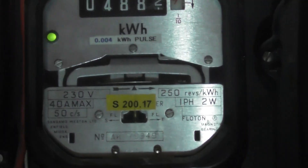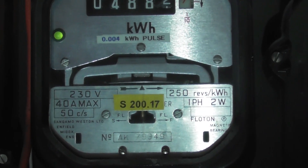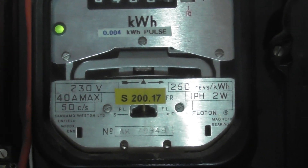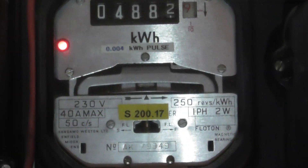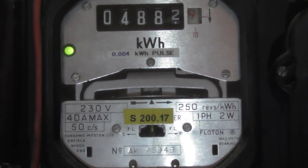I'm just documenting this. This meter provides pulses to the summator which I got in the hallway. There's one pulse per four watt-hours, one revolution of the disc. I explained these summator meters in the workshop — how they work.